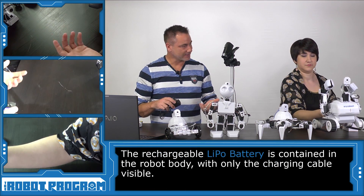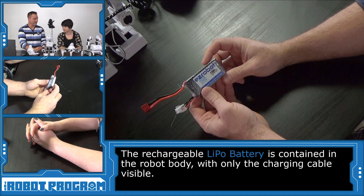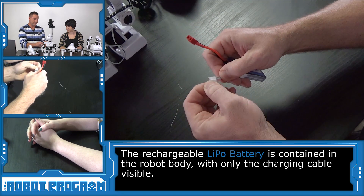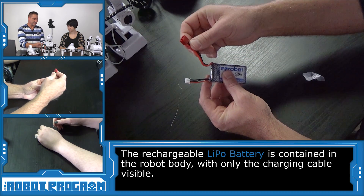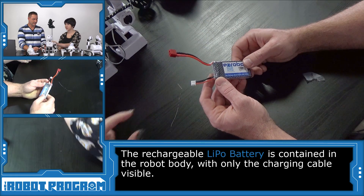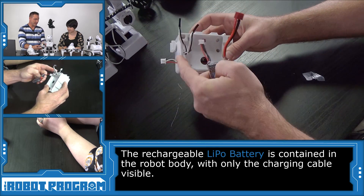One of the questions people ask is, where is the battery and what does it look like? It's inside of the bodies. This is called a lithium polymer battery, and it has a connector on the end. On this side is the power that connects to the insides of the robots — this is your charging piece, and this is the piece that connects directly to the controller, to the fuse, and to the servos. So the only piece we actually see when we build our robots is this part right here. The battery lies inside of JD just like this, and that's why it pops out on that one end.